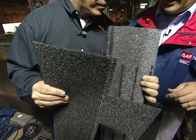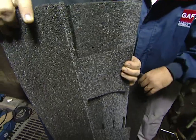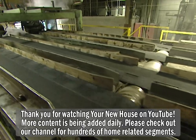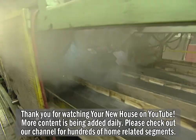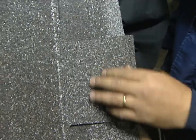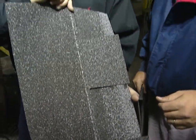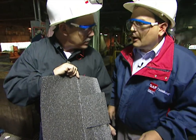We take the piece that used to be on the side of the shingle, add some laminating asphalt, and adhere it to the tabs that we now have. This is quite different from standard shingles — this is what we call a dimensional or architectural shingle. This is our Timberline series, and it has a lot of advantages over old strip shingles. The tabs are tightly adhered to the back, and the shingle has multiple dimensions and various color patterns for much more contrast. It also makes it more wind resistant so it doesn't blow off as easily in a storm.